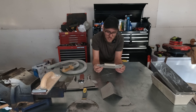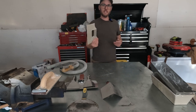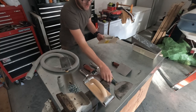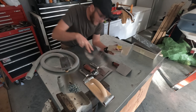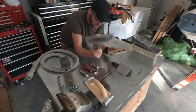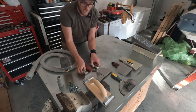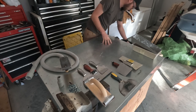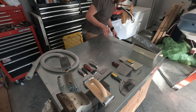This is a 10-inch multi-edge scraper — I use it to scrape buckets, because if you want to clean them out as you go, you're always buying new ones. Here's a tip: the more things you have to scrape with, the better, because scraping comes up a lot in drywall work. Use something sacrificial — either a dedicated scraper or a two-dollar plastic scraper — for scraping. Never use the knives you're actually trying to make money with, because chips and nicks show up in the finished product. I've also got a one-inch knife for nooks and crannies.